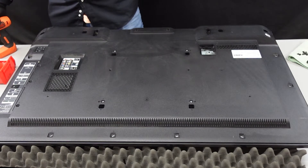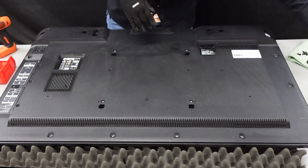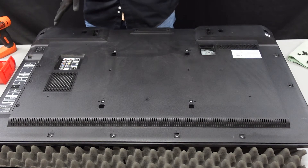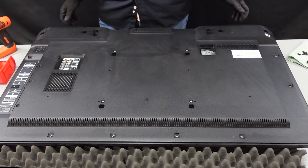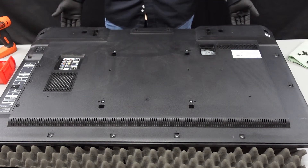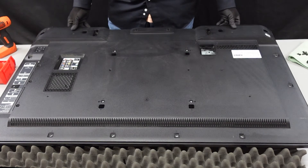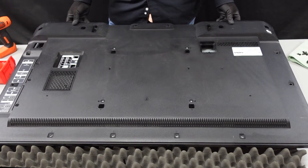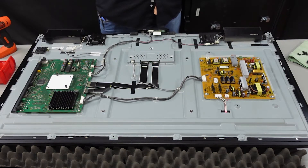We want to do a once-over just to make sure we got all of the screws out of the back. Do keep in mind there are going to be two or three different styles of screws — keep them separate from each other and remember where they go, it makes it a lot easier to get it back together. After we have the screws out, there are two small flares on the bottom that we can use to lift the back up and away from the chassis. The whole thing comes off very easily and now we have access to the boards.